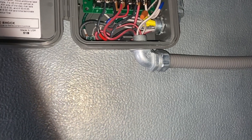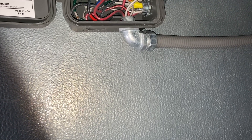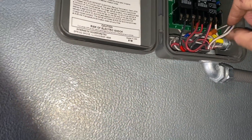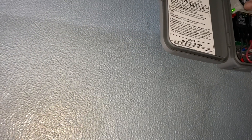To get her to go into defrost, we're going to take the X terminal out, which is our defrost termination. We'll take the X terminal, which is on the end over here. Be careful — X is hot. It'll have voltage on there, so you're going to want to kill power to do that. Then wire nut that connector until you change your defrost termination switch.